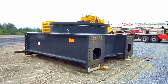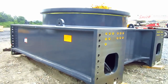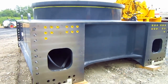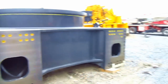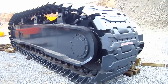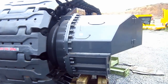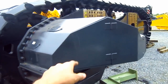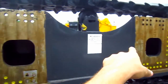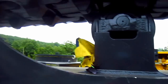This first piece right here is the main car body section. The center frame on this machine is an H-type, and each crawler will attach to this section by 62 high-torque bolts. Here you can see one of the massive crawlers for this machine. Each one measures 29 feet in length and 8 feet 2 inches in height, and consists of three top rollers and seven bottom rollers to support the 49-inch, 47-inch cast track shoes.